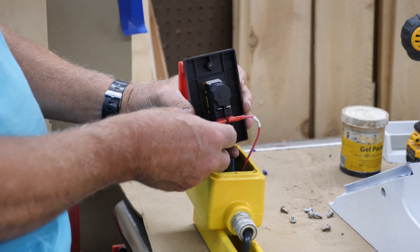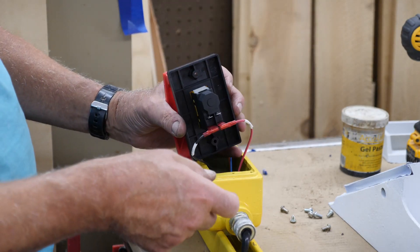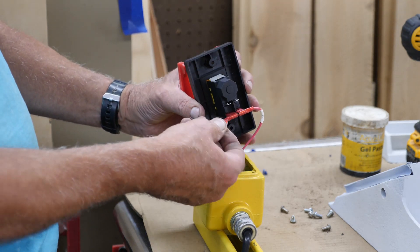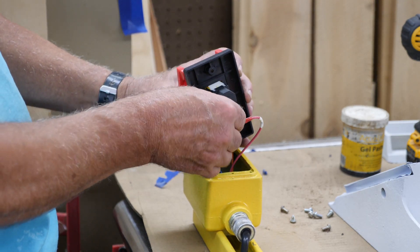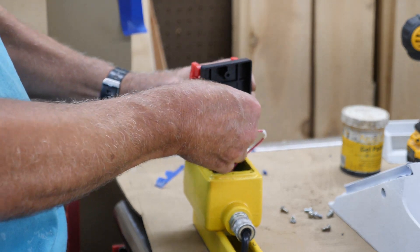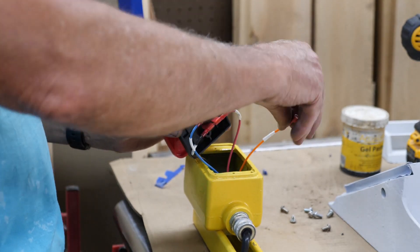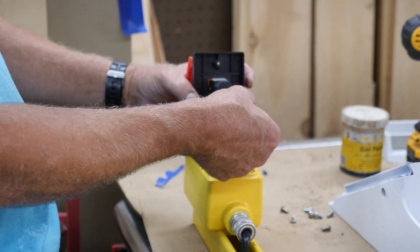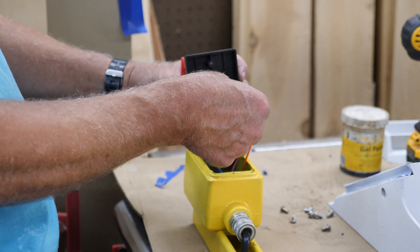You want to make sure these fit good and tight — if you can just slip them on, you've got something going on that's wrong. So T1: I'm using blue here for that, and that goes right above your L1. And T2, which I'm using orange for — but you would probably be using white — goes above your L2.